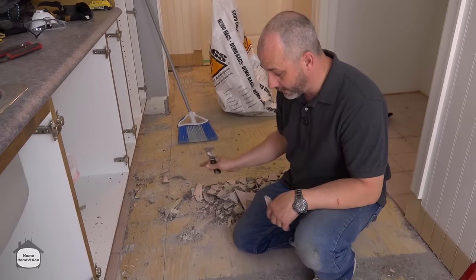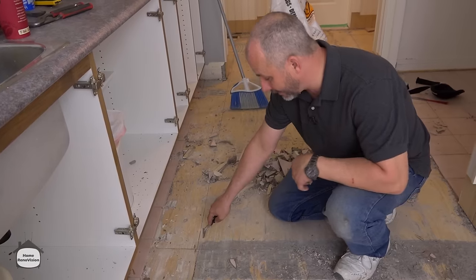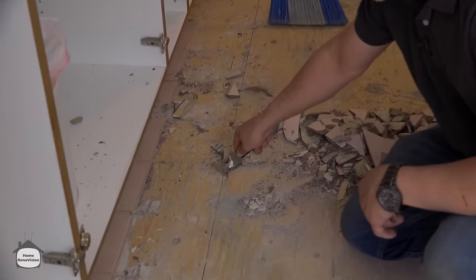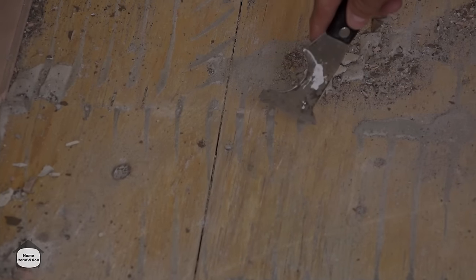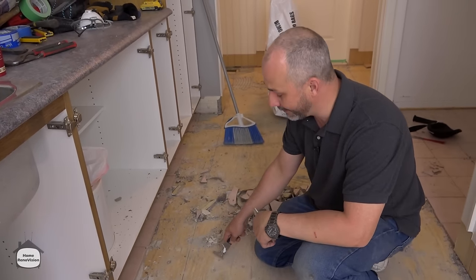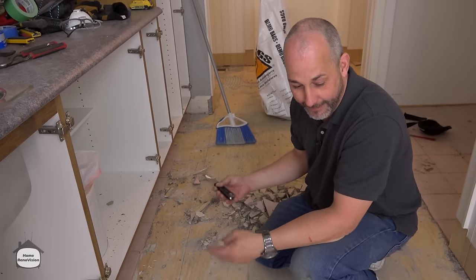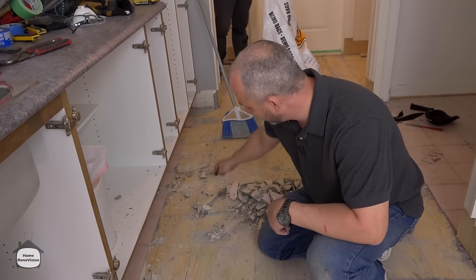Past this point it starts popping up real clean and easy. There just aren't enough screws in this plywood. These joints line up — they should be staggered, which gives a lot more strength, especially in a hallway. The screws here are about every eight inches, which is not enough because there's another linoleum floor underneath with another quarter inch. You're not just attaching this plywood — you're sandwiching and bonding all of that together. These should be every two inches along the edge and every six to eight inches in the field. If you're going to cheat and go over top of an old floor, you should go every six. There are a lot of areas where the grout is chipping out, and it's because of movement from misaligned joints and not enough screws.